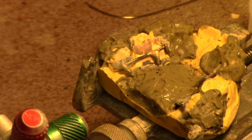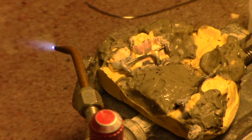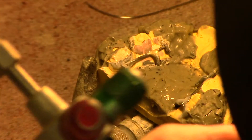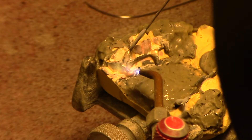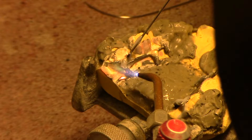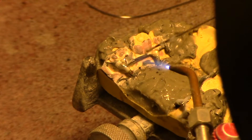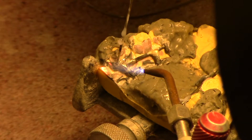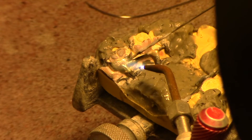On the posterior part I'm not going to use solder directly — I'm going to use the probe instead with a little bit of flux on it. I'm going to heat up the joint; this big wire is freestanding so it's going to take solder pretty quickly. I'll put the solder on there and then use the same probe to move it around — kind of like a little paintbrush to paint the solder where I want it. This is a real good technique for beginners so that you get a good sweat.